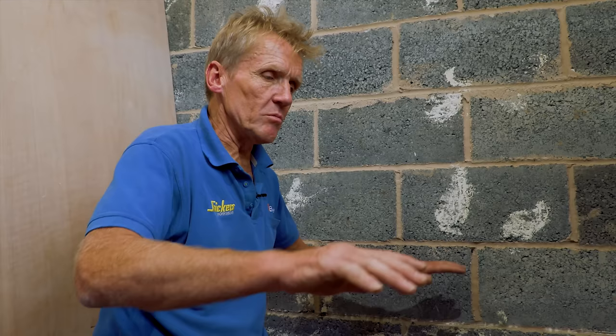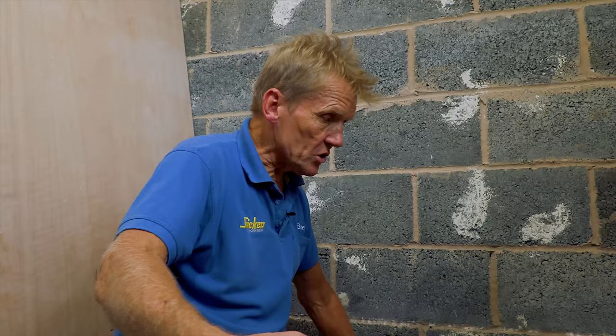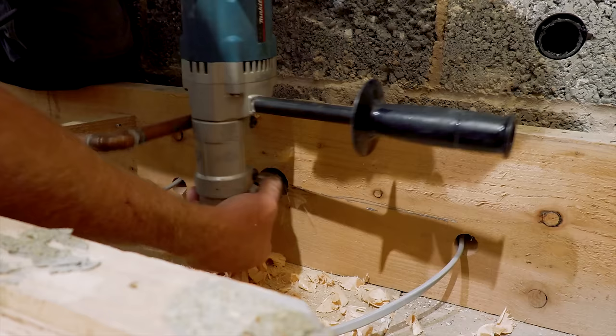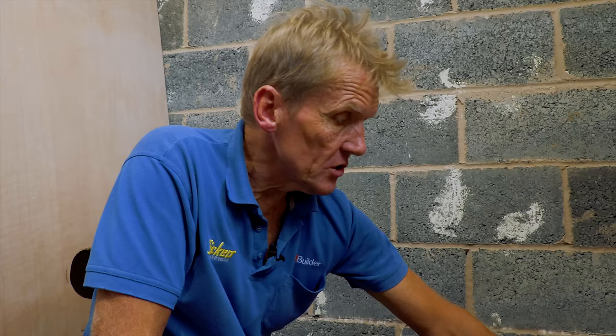Having said that, I still don't like putting holes in joists if I can manage it, but I've got to get this waste out. My whole mission here was to put this tray right down low, flat on the floor, so I've got to put the waste through the wall here. You can see it used to come through here above the floor — that's where they had the shower tray on legs. But I'm going through here, and that hole is just on the limit of what this joist is allowed — in other words, two inches on an eight-inch joist.